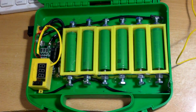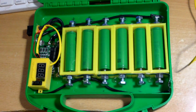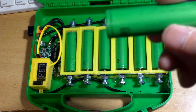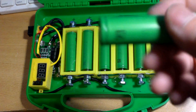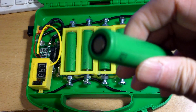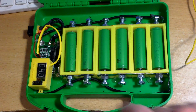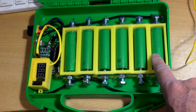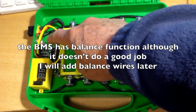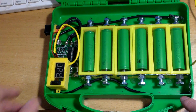Using this design, I built my 12 volt 6 amp power bank. I'm using this type of battery — a Sony 3 amp 18650, weight from 44 to 45 grams each. This setup would be 6 amp and I added a 3S 40 amp BMS and a voltage meter.